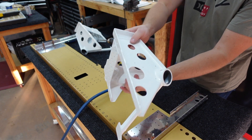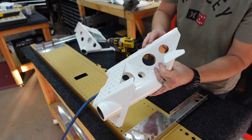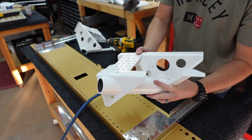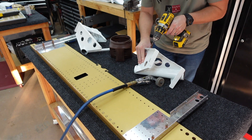When you receive these from Vans with powder coating, it tends to leave a little bit of powder coating inside of those holes. So I'm going to go through right now with a number 12 bit, just clearing out the powder coat — not really cutting into the metal. Then I'll clear out the AN4 bolt holes as well, so let's do that right now and we'll continue forward.